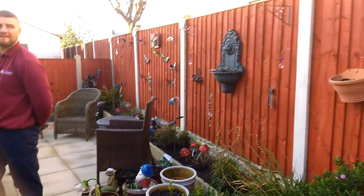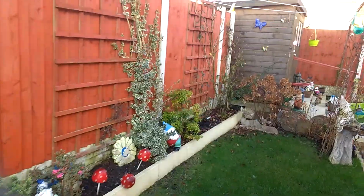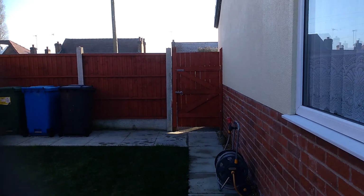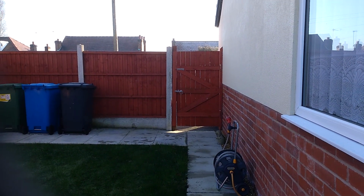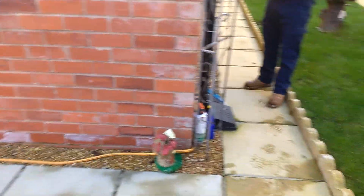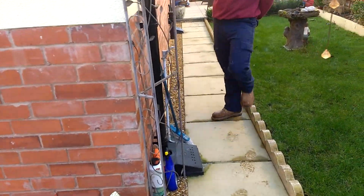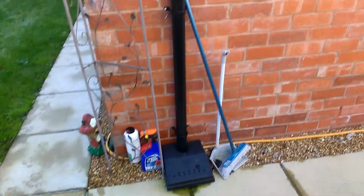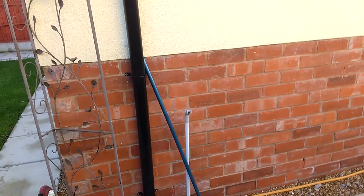The fences of the perimeter of the property seem to be new and in good condition, with one slight problem, that's the gate. The gate's catching and doesn't latch properly, essentially because of poor workmanship. We've found no evidence of cracking, movement or subsidence in any of the external brickwork. So yeah, it seems good at the moment. End of this first report.